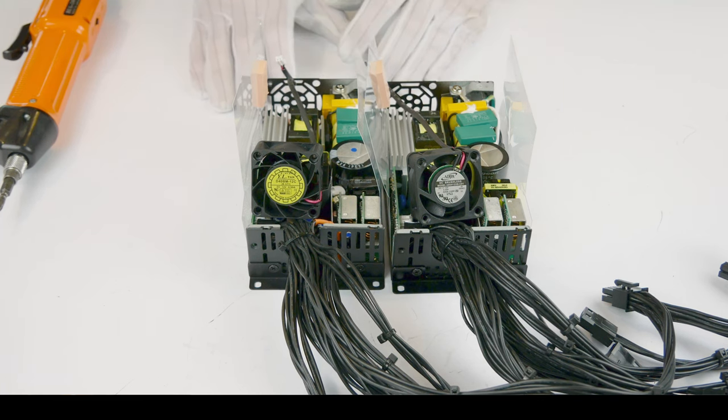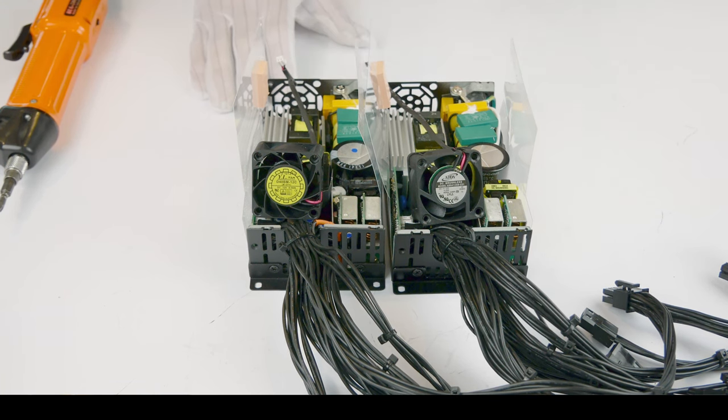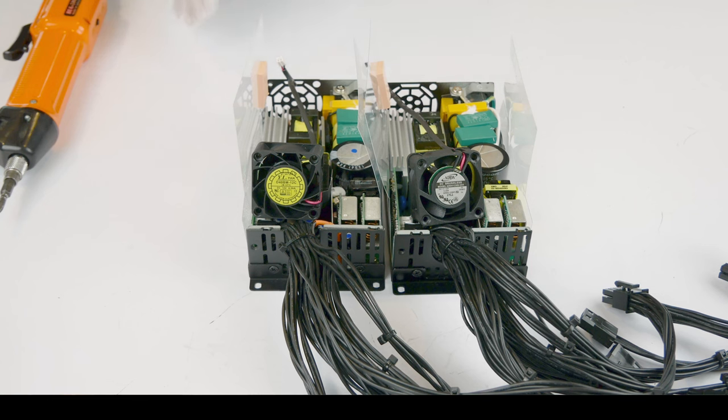Anyway, both are extremely well designed, and the fan speed doesn't step up above 5 volts DC whilst loads are below 500 watts. In fact, it takes a heck of a lot to get them to step up with full load on them. So whilst we trade off 100 watts of max power, we can then use a 5 volt fan. At max speed, these push out just 5.5 CFM.